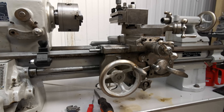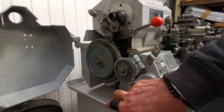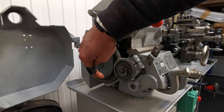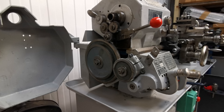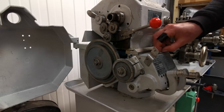Right, I am missing a few gears. This bracket here is actually Y-shaped, and some of the different pitches require it to have an idler gear fitted, but I don't have the stud for it - which negates a load of pitches I can do until I get one. I'm also missing a couple of gears. I am tempted to have a go at cutting my own gears because I could do it on the mill - I'd need an indexing head and a set of cutters - but there's no reason why I couldn't make my own gears.